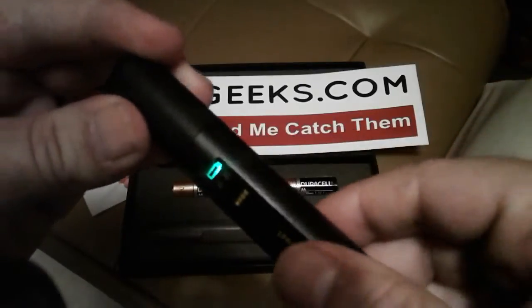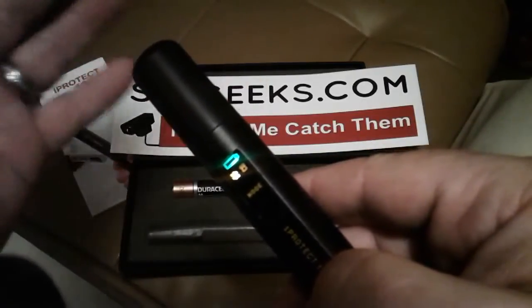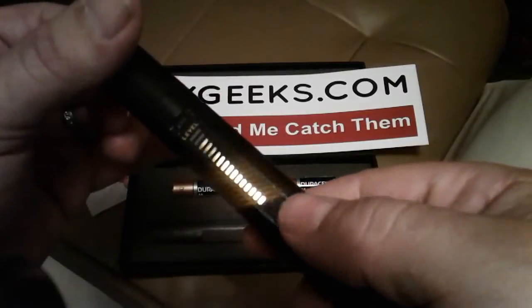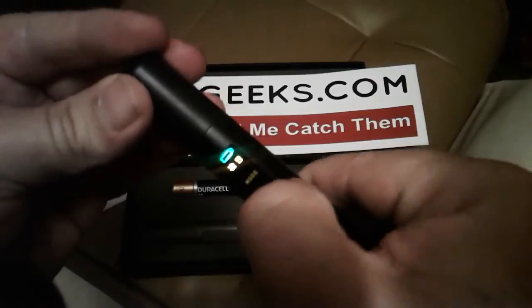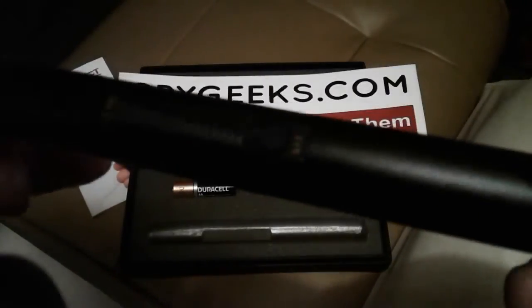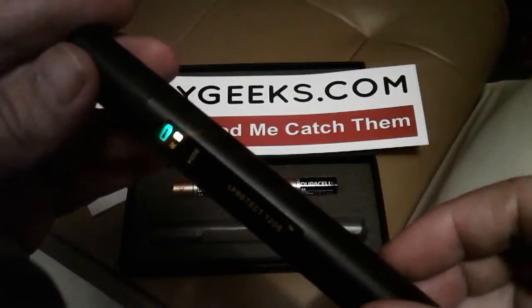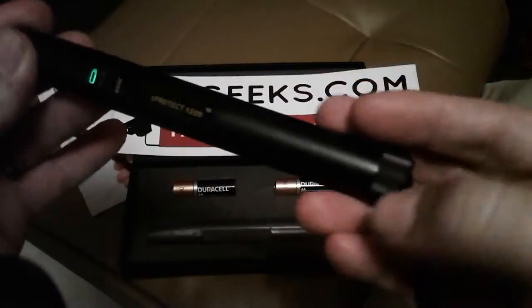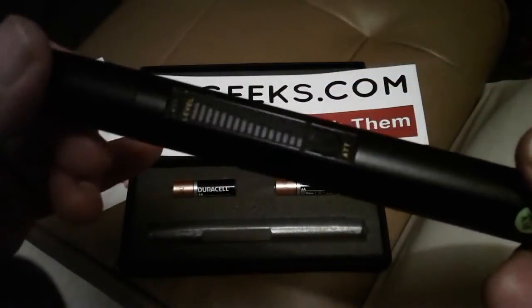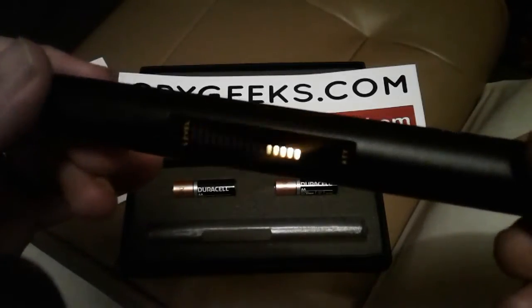A little about the modes. If you press the mode button firmly, you'll see the orange light comes on — that puts it in vibration mode, so if you're picking up on any radio frequency it'll vibrate and the lights will also flash. Press that button again and it goes to audio mode, making a faint little sound. But I suggest don't use audio or vibration — just use the lights. The reason being, if someone has bugged you and they hear something beeping coming towards their bug, they might turn it off.